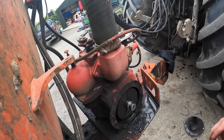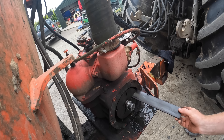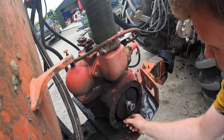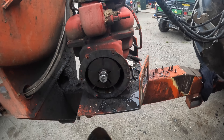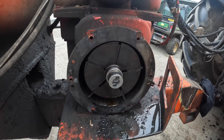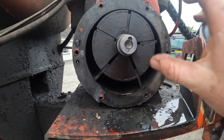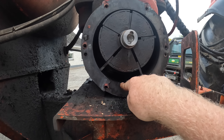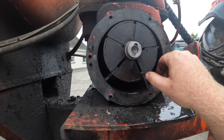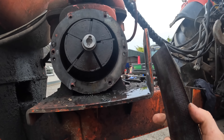Compared to our other tanker this actually looks fine - I actually think none of these vanes are damaged, they're in perfect order. This turns out that this tanker is just a slow tanker - the vanes are perfect, that was an unnecessary trip. I would have assumed just based on how much slower this tanker was that we had vanes stuck. It was just a smaller pump. If you had the two tankers side by side you'd probably see the difference - the other tanker has larger vanes and brings more air in and out, that's why she feels quicker. But they're fine, there's a bit of twist on them - ten years of work.